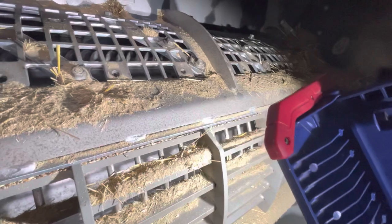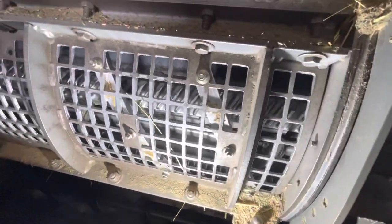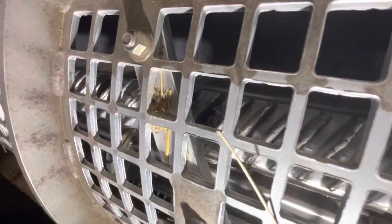And so I put all these in here, and that really made a difference in green stem soybeans. I also took, and I'm trying to see if I can find one here, on the rotor drum itself, and installed, right there's one. You can kind of see it right down through there. There's one. That you see that paddle? They call that a Sunnybrook sweep set. And basically, what it does is it just helps to transition everything through.